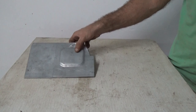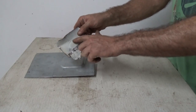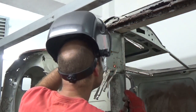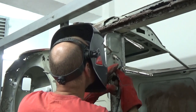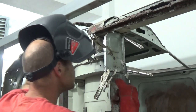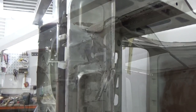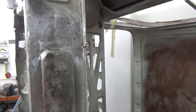This is the panel with the recess formed in — it came out very close to the original one. And this is the original recess we wanted to copy. As you can see it has a sharp corner on the top and just a bit of radius around here. We used the grinding disc and the flap wheel to finish off and smooth out the grinds. I'm pretty happy with how it came out, apart from a little distortion here in the middle. The results are quite good.